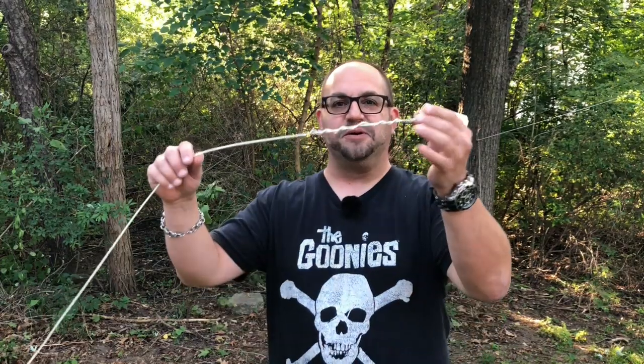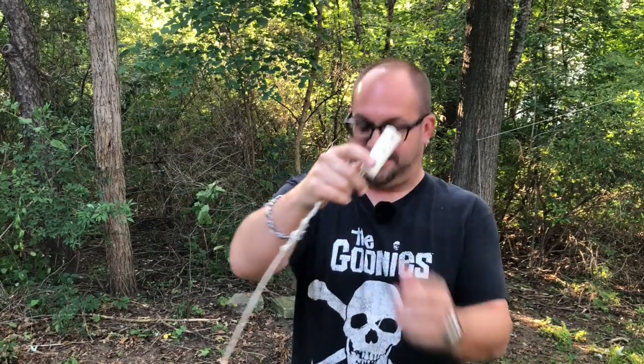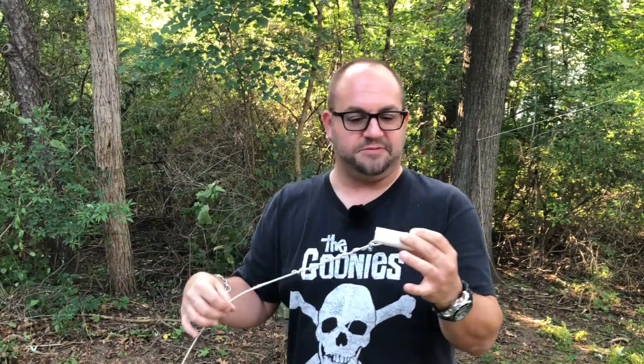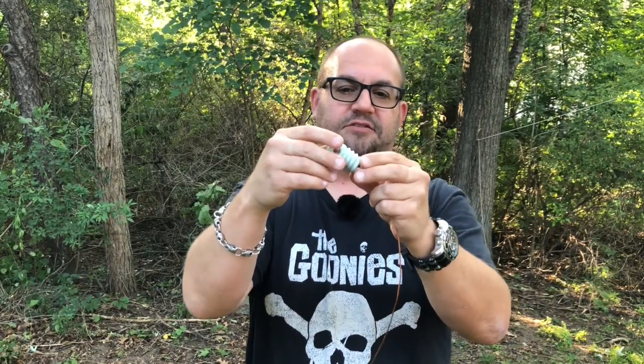In terms of construction, here's my old dipole — I used 14-gauge wire and cut some PVC. This was the old insulator, and hey, it held up. Not bad for a new ham and their first antenna. This is the new MFJ antenna — stranded bare copper wire and some nice ceramic insulators. These are definitely more high quality than what I did, and it's got a nice crimp connector on it as well. We're going to tie it up and hoist her up in the air.